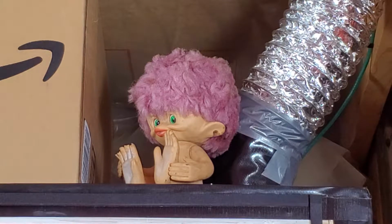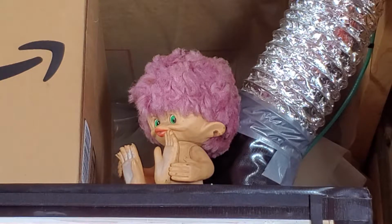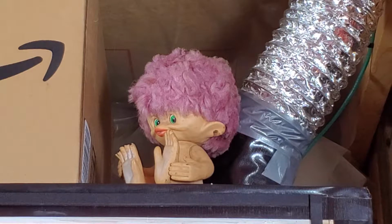So anyway, I'm going to add that. I actually have already done so, and I'll show you the cables and then the sensors real quick. I'm not going to show you the code because I think it's pretty simple. I took the code that I had for the BME280 that you guys have seen, and I basically just added more variables in the config.py and copy pasted the moisture code where I needed to get the moistures and set the highs and lows, and then send it to the Blynk. That's all it's doing right now.